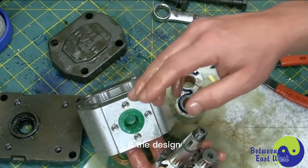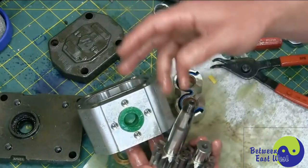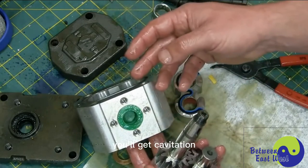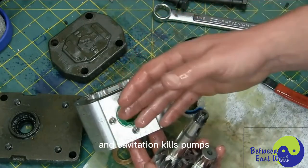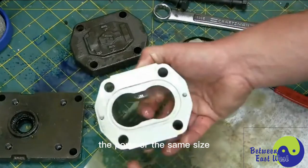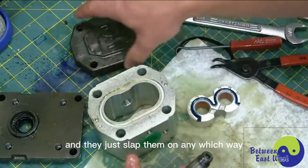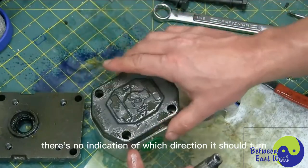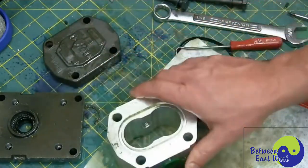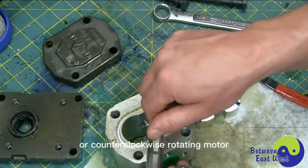If the design of the equipment is poor, you will get cavitation. Or if you're turning the pump too fast, you'll get cavitation. Or if the oil is too thick because it's cold or incorrectly specced, you'll get cavitation. Cavitation kills pumps. What if you get an off-brand one and the ports are the same size, because they want to make them cheap and just slap them on any which way, and there's no indication of which direction it should turn — no arrow saying inlet and outlet? How do you know which way this shaft needs to turn?